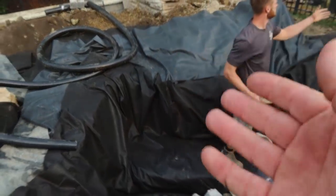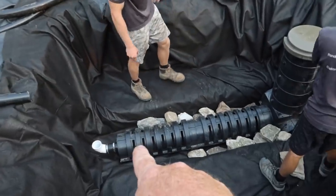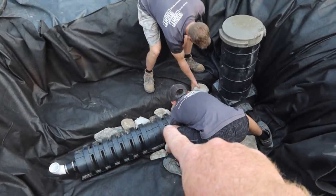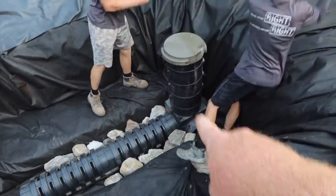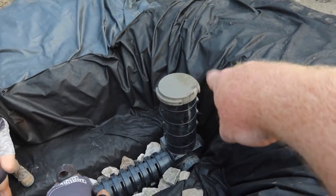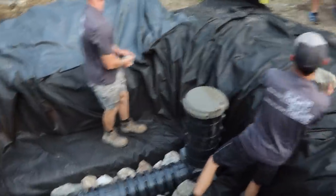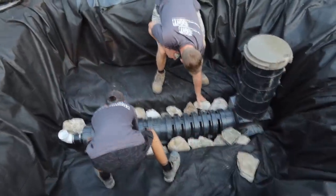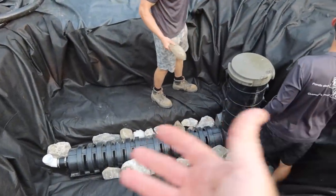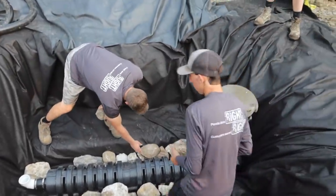The whole purpose for the centipede and the snorkel is not just to allow water to come in and rise up through the aqua blocks and through different layers of aggregate as it moves up to the surface. It's more there so we can clean it out. Solids and stuff will settle out in the bottom of the centipede, which is pitched to the snorkel — recessed even deeper. Once a year I can take the lid off, drop a sump pump in, and pump out the sludge. Without the centipede and snorkel, all that silt and fish waste would move up into our rock and gravel, eventually clogging it.